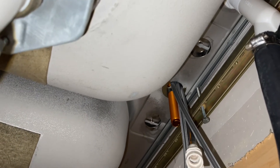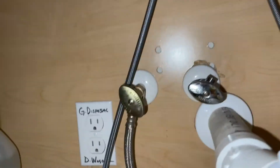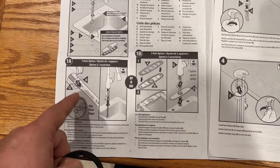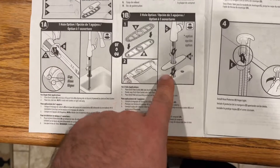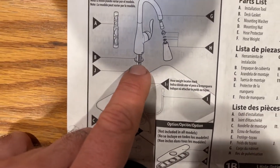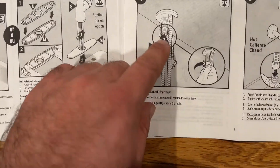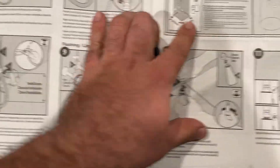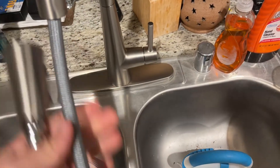The only thing I have left to do down here is hook up the pulldown faucet, then hook up the hot and cold, and of course plug my appliances back in. I'm going to throw some Teflon tape on here. One thing I want to mention is this little gasket — it appears to only be for single hole mounting. I'm using this method and it doesn't call for that, so don't worry about it. If you're installing it this way, you'll want to put it right underneath the faucet. This hose protector goes on right here and just threads on finger tight — no big deal. Then we'll hook up the water lines and go from there.